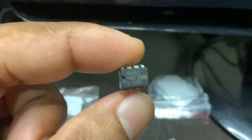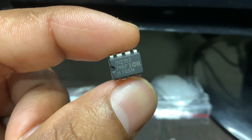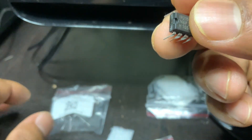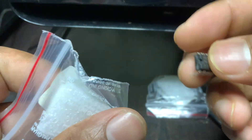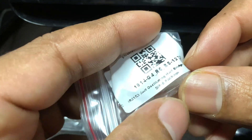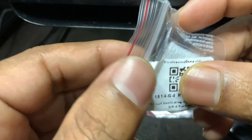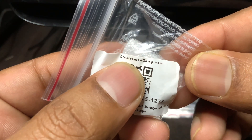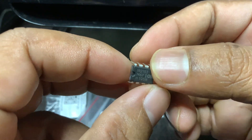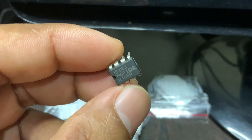The signals switch the MOSFETs alternately and create a 50% duty cycle waveform, suitable for half-bridge inverter or push-pull circuits. It also has built-in protection: if the supply voltage drops below a safe level, the IC shuts down to protect the circuit. There is a 15.6-volt Zener clamp inside to prevent the voltage from going too high, and the CT pin can also be used to shut down the circuit externally — like giving the IC an off switch using a small signal.